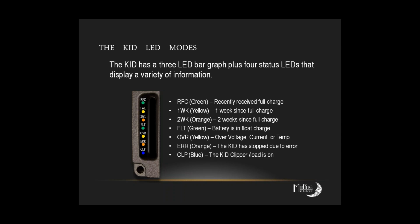Yeah, that's going to be pretty heavy overcast. This is fairly large arrays you've got on here. If you've got, say, 4 of the 285s on here, you're going to get a little something through. I would like to think that you're probably optimized for low light conditions. You might not hit your 72 plus amp hour a day target, but you would get something through. So it would be a pretty nasty day where you didn't see any of the charging lights come on.